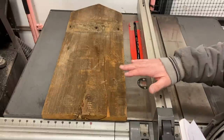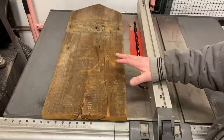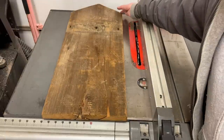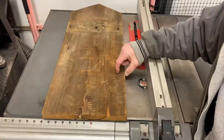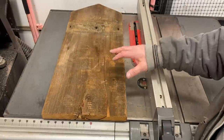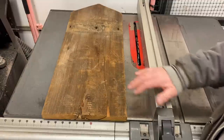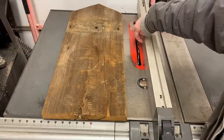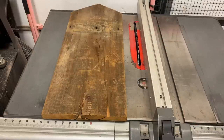I started by measuring all of the tubes in all of the kits I'm going to be making, and it came to a total of 41.75 inches. Measuring this board, I'm looking at 26 inches, so if I cut a three-quarter inch slice from each side of the board that should give me enough material to make all of the blanks I need. I've got my fence set just a hair over three-quarters of an inch from the blade, and we're going to cut two slices off this slab of wood.